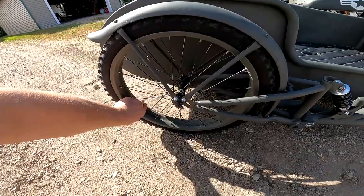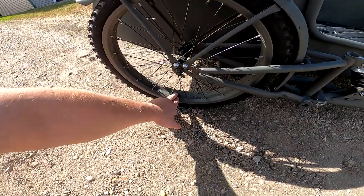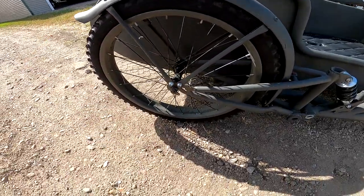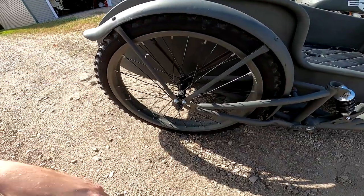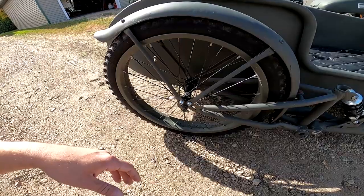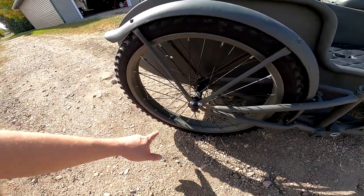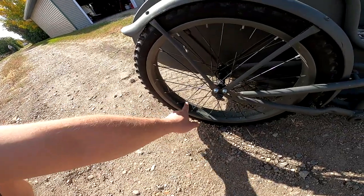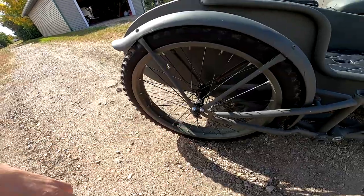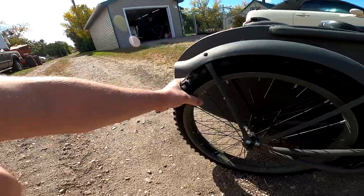And now this really fat wheel. This is two steel 20-inch wheels. I cut a lip off and welded them together. The inside, I sanded smooth, put a bunch of duct tape around it as a big, wide tube tape or whatever to wrap around there, pretty much to protect the tires. And then I spoked these. I lined up the holes when I welded them, so the spokes are the same, they're just more offset now.